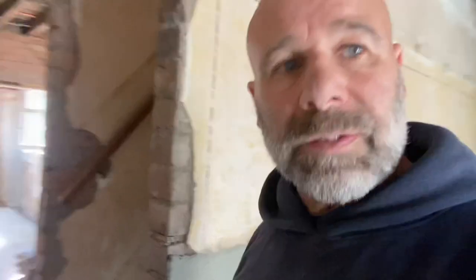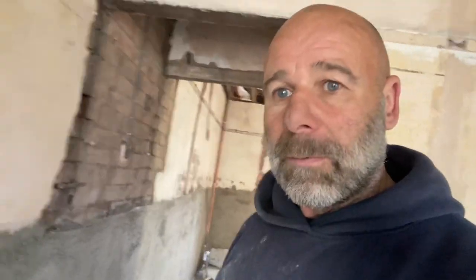The time it's taken me to stick all this backing on - if I'd have done it just as a plaster system with plasterboards, I could have had it done in a day. It's taken me two days. And that's one of the reasons why I say express plastering systems are quicker, cleaner, faster, less mess, less dust - everything. But sometimes it's not the right option.